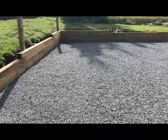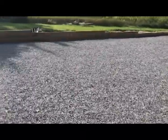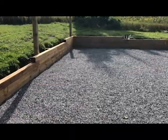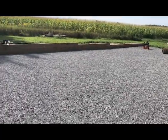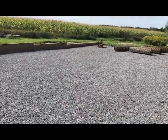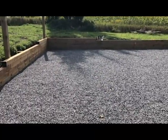Here's the project I'm currently working on. I'm pouring a 40 by 60 concrete slab out to this location. The grading's already been done, as you can see. I've got my retaining wall built and I've got my reinforcing steel mesh on site ready to roll. So my next step is to layout and install my formwork, and I'm going to use the retaining wall as part of that formwork to retain the concrete as it goes.